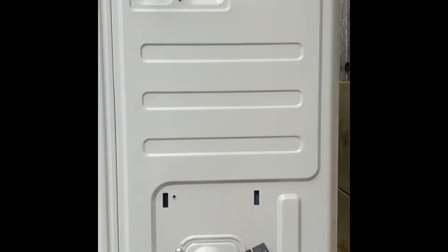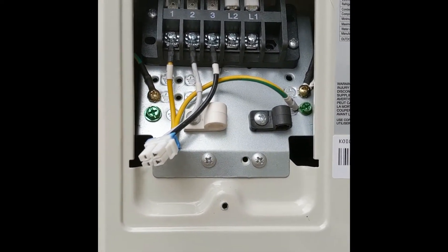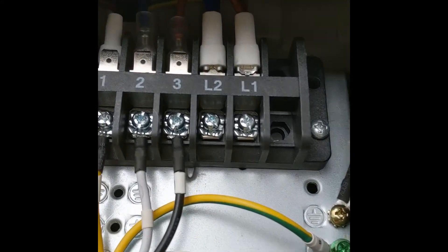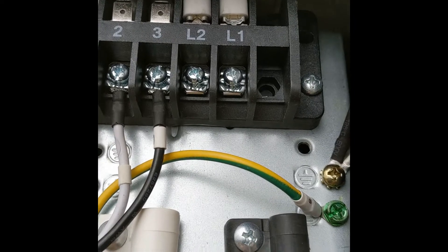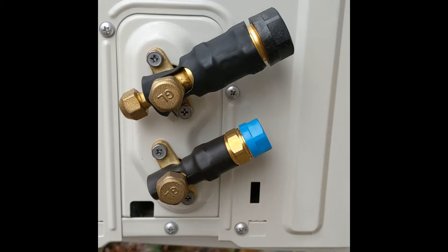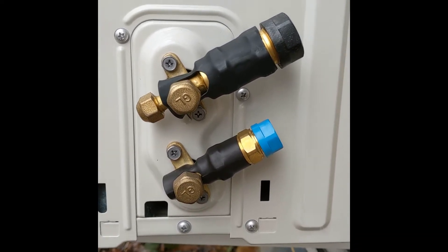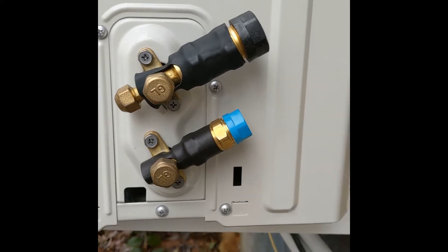Here's a quick shot of it with the cover off the side. There's your quick connect for your control and air handler power. L1 and L2 for the 240-volt coming off a 12-2 wire with a ground screw. And our gas line connections are here. I'm not even going to attempt to hold this phone while I connect the gas lines, so I'll come back when it's done.